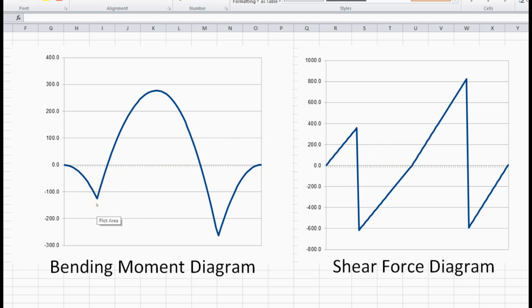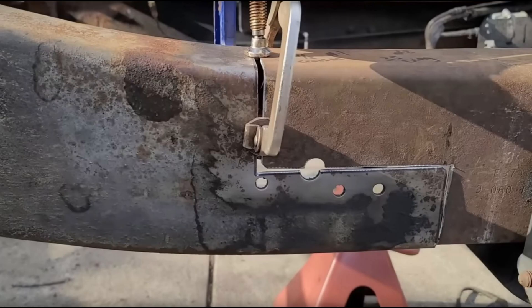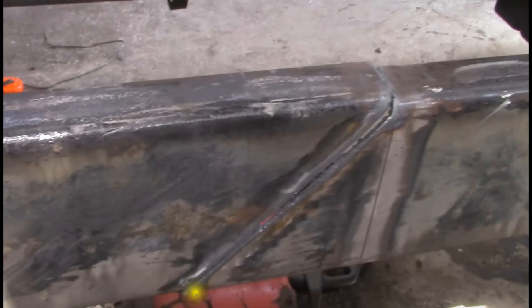A small hint: if you are locating a splice in the mid section of a chassis, the ideal place is about a quarter of the span from either the front or the rear spring carrier — the bending moments will be low, and if you can find the points of contra-flexure they will be zero. My final comment regards the use of the Z-shaped cut used for main splice joints — these seem to be quite popular. People often also use angle cuts, as seen in a video entitled 'the correct way to shorten a truck chassis.' I assure you that these angle welds are no stronger than simple perpendicular welds and are a great deal more work. They are simply never ever used in the structural fabrication industry.